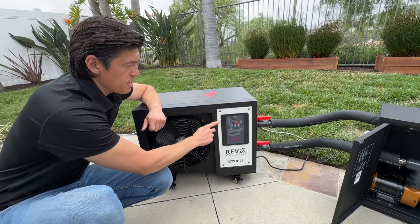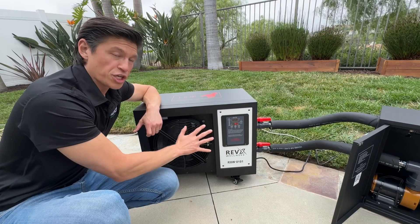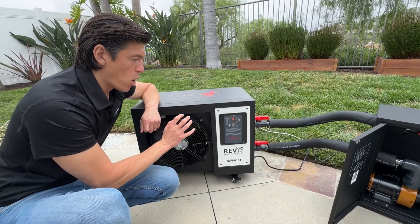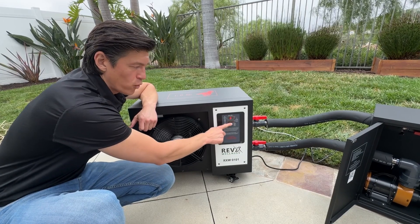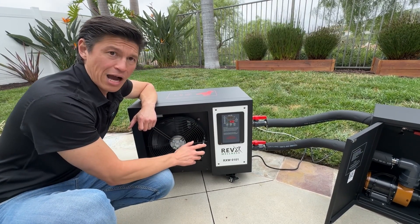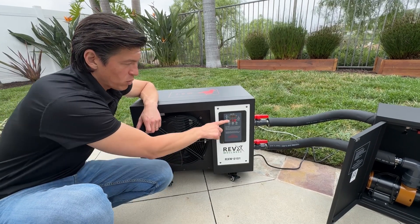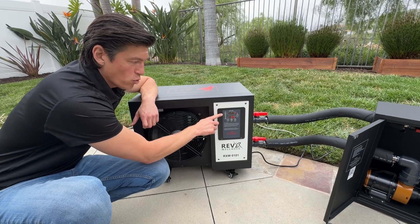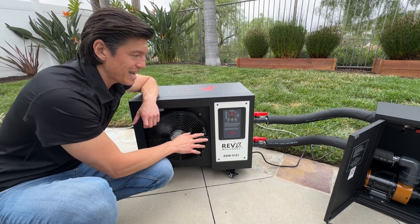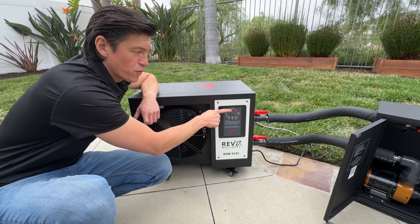When the green LED light is no longer blinking and the fan is spinning, your chiller is in cooling mode. It will cool the water down from 67 to 45 degrees. This will take a couple of hours depending on outdoor temperature and other factors. Once the chiller cools it down to 45, it will go to complete mode and enter an idle state.